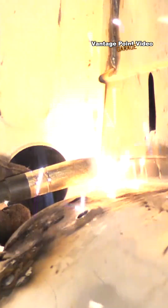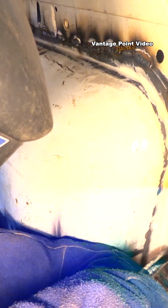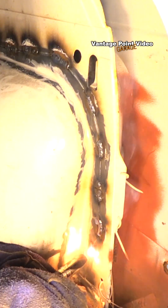And now I'm doing a continuous one over some light welds on the base of the wheel arch. Still flaming up a fair bit for me, but got a good weld there now, and that's joining the floor panel and the chassis member that comes up from the bottom and the edge of the wheel arch. Worked all the way around the top of that as well.